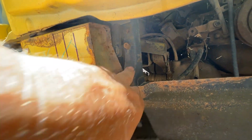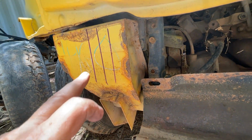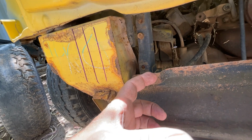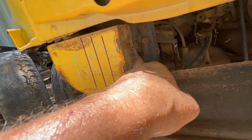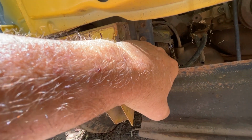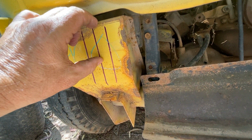But you can't go down here too low because you see the distance and you've got a slope, so you're not going to get a drill in the back of this. You're only going to be able to drill in from here. If you try to drill in from here, a lot of times because of that curve, if you don't have a long, say a 1/8 or 3/16 bit that will reach over here, your bigger bits are just going to want to walk down. They're just going to walk down because this is slanted at an angle, even on the inside, and it's just going to slant down. You're not going to have good luck. So you really have to get those bolts right here in this space before you get to that curve, or right at the beginning of the curve, you could probably get it. It'll probably grab right there. And that's it. That's all you're going to have for the bolts.